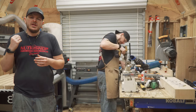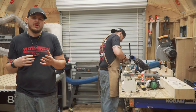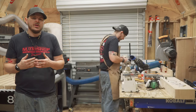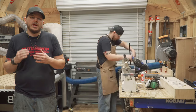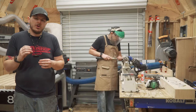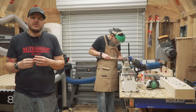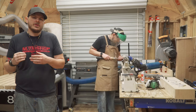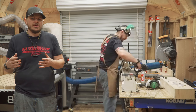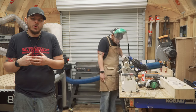That being said, keep in mind when you're casting things with epoxy, if you can do more than one at a time, you might as well. In my opinion, if you have the materials there to do it, why not do more than one? Not only that, but when you're doing epoxy pours and mixing epoxy, the smaller the amount you mix, the harder it can be to get a ratio correct. You can't get 1/3 of an ounce dead on without a pump system, which Total Boat does have, but I usually just mix using the mixing cups for the larger pours.